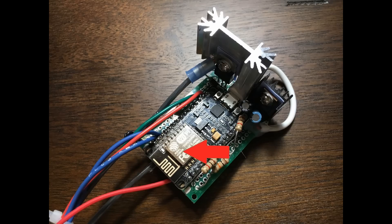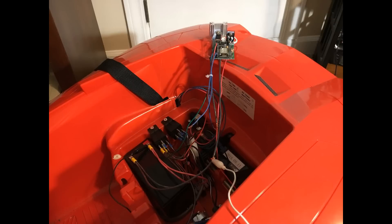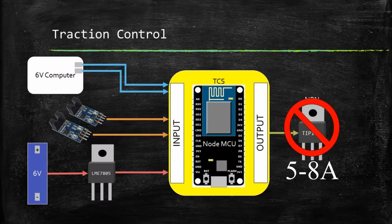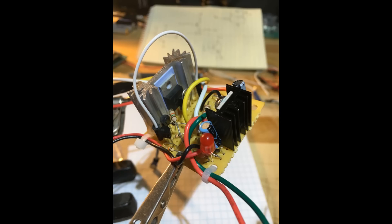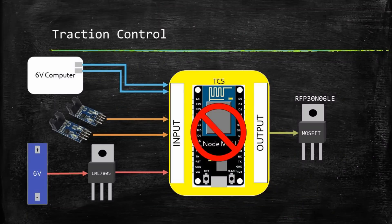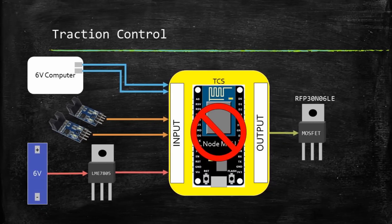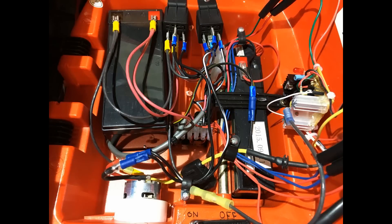Here's the first board I made. Here's the NodeMCU. This is the TIP120 and the 5V 7805 regulator. This is what the setup looked like when I was doing testing. The problem I found was that the TIP120 only has a 5 to 8 amp output, but the new motor has an inrush current of over 20 amps. So I replaced it with a 30 amp MOSFET and also rebuilt the power board and added a sweet LED. The next thing I did was blow up my NodeMCU — and I did this twice. It turns out it is very unhappy with the 5V output of my optocouplers.